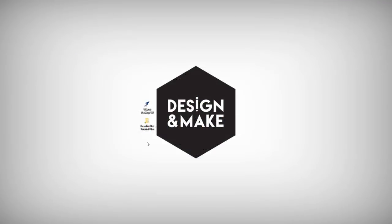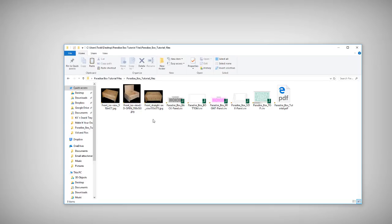I've unzipped the Paradise Box tutorial files right onto my desktop. Let's have a quick look before we start making any edits. Opening up the tutorial files, you'll see three beautiful images of the Paradise Box as it was meant to originally be made, plus the Paradise Box tutorial PDF with instructions. I'd suggest you take a look at that if you've never made one before, just to understand all the intricacies of running the toolpaths and how Michael Taylor originally wanted you to make these. We have five CRV files that work in VCarve Desktop, Pro and Aspire, and we're going to modify only three of these. The bottom and the side we'll leave exactly as they are.